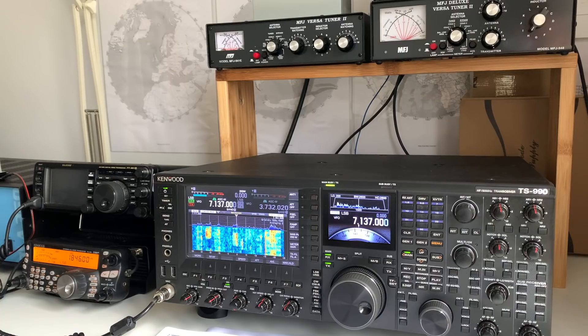The problem was only occurring above about 120 watts on top band. I tried several things — even though I was fairly sure it wouldn't help, I added a separate earth for the rig chassis, since I hadn't had a separate earth on any of my rigs or the MFJ. That made no difference. While talking through it with Jeff M0UHF, I noticed that when I wasn't transmitting, the forward and reverse power needles on the MFJ weren't actually seated at zero, which I thought was odd.